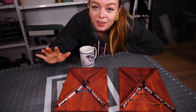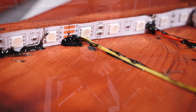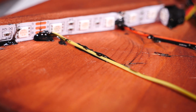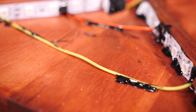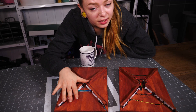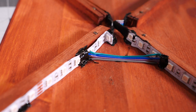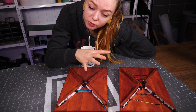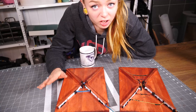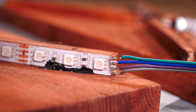Life lesson: how not to solder RGB LED strips. You can probably see a clear difference between the soldering on these two lamps. This is how you shouldn't do it — here I have connected a single wire from green to green, red to red, and so on, so it looks very messy. What I've done differently here is connect the LED strips together with four wires that are attached together, so it looks a lot cleaner. It doesn't matter because both of them work — it's just cable management. I've covered it up with hot glue to protect it, but the soldering itself looks just like this.